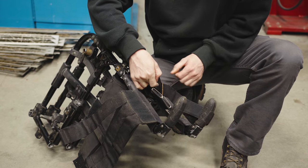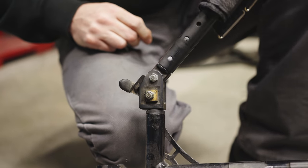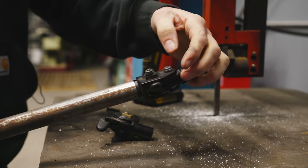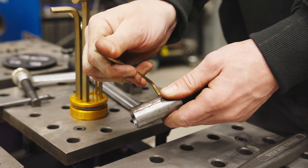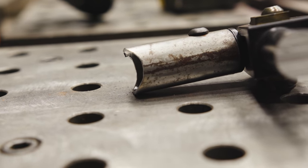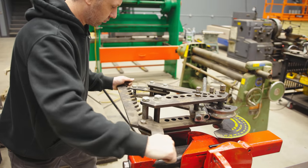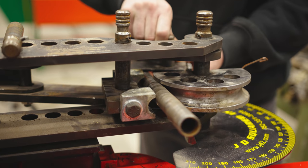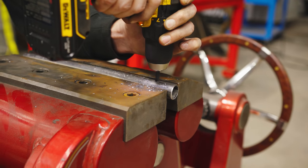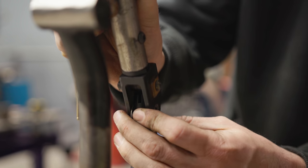The original ankle brace design was just a rigid post off the mainframe — it didn't allow any movement of my ankle in any direction. The new design adds a pivot right at my ankle location, which will allow me to squat, bend over, or even skate. Looking at the wheelchair, I found this pivoting handle component that's going to limit motion in one direction — and these joints fit perfectly inside the one-inch tube steel. In order to get this working properly, this joint has to be right at my ankle line, so I made a little tube extension to get it up about three inches. I also had to bend in a little S-curve to get the offset I needed, and I pinned the aluminum wheelchair pivot joint to the steel riser piece with a bolt.